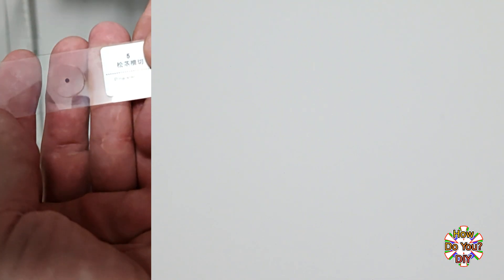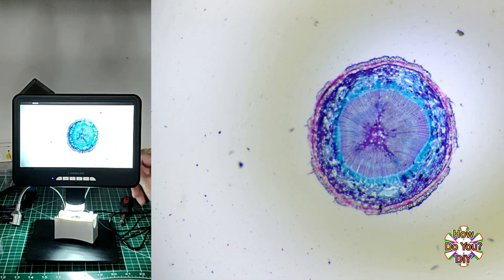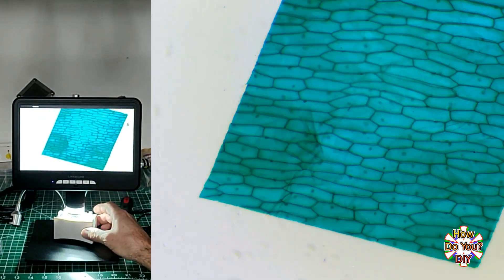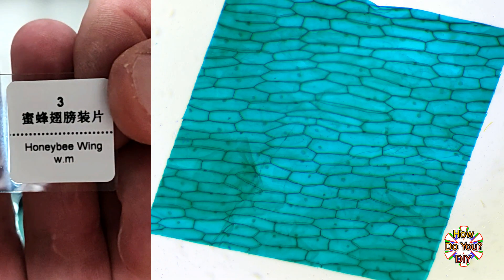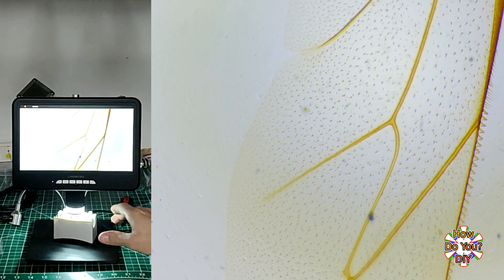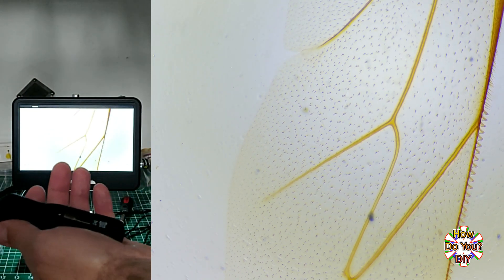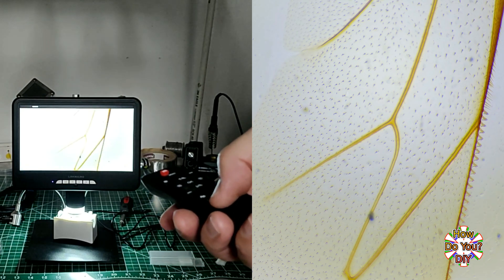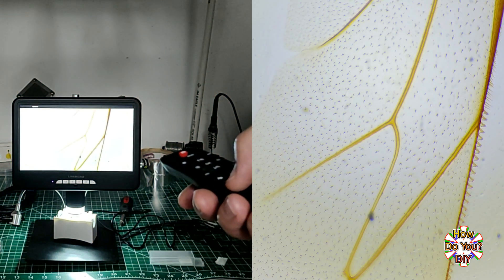Now let's check out this glass slide holder. It has a light inside that you can power with the barrel plug for the auxiliary light on the base. On this first slide we're going to look at the dark dot in the middle. When adjusting the microscope closer to the slide, pay attention to how close you're getting so you don't crash into the slide with the camera. Now that it's focused on one slide, I can change slides without needing to refocus. I also want to show you a couple of cool features with the remote. You can stop and start recordings; one button switches between black and white and color; another button will invert the colors. These features can be handy for showing details that are hard to see normally.